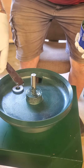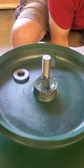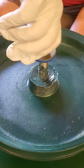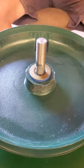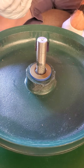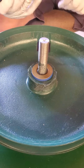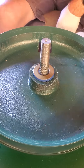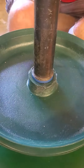So I pack it about like that. Then just drop the seal down all the way to the end. Now this tool is probably as old as the machine — it's a specially made tool that Mel Divig made just for this machine — but a piece of PVC pipe or a piece of pipe that will fit down over the shaft and under the seal will work just as well.